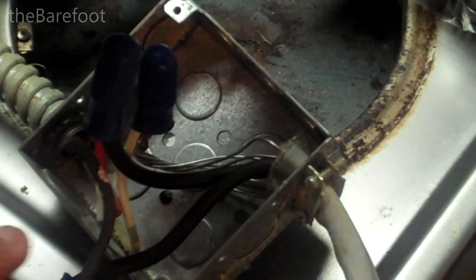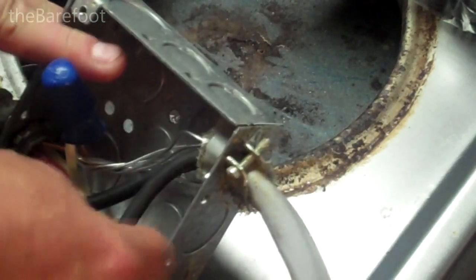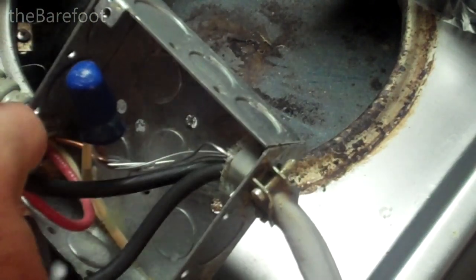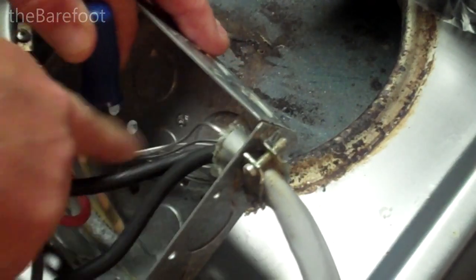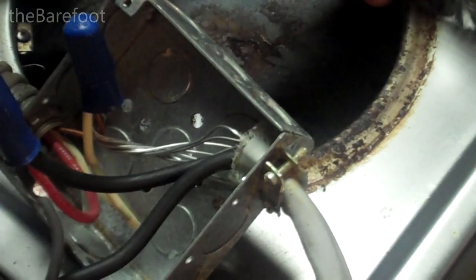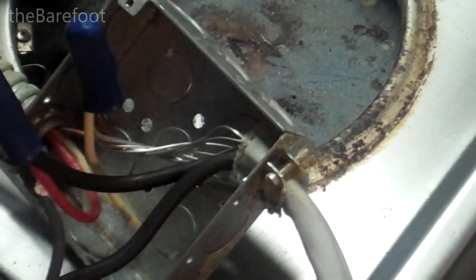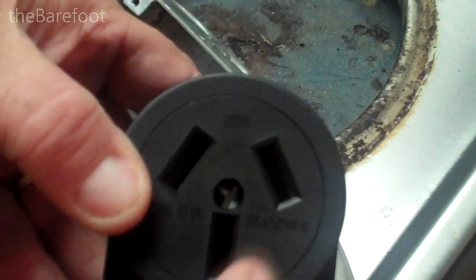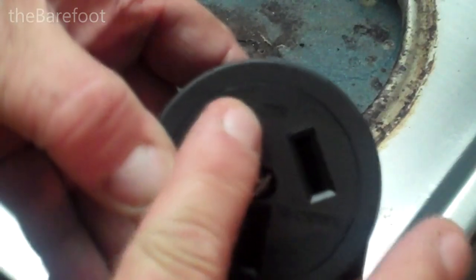This shouldn't be too difficult. I've turned the breaker off. What I've got coming in here to the box are these two black wires that go to the gray and the red, which are your power — your hot wires. And then this bundle of aluminum, it looks like, that is serving as the neutral and ground tie-off. So all I need to do is take this to a standard 250-volt, 50-amp surface receptacle for a three-pronger and wire it up so that the bottom is the neutral and these two guys here are the hots.